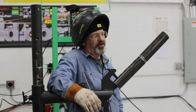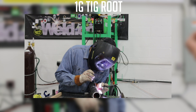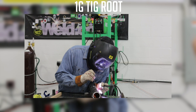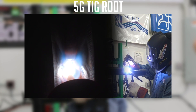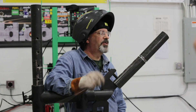We've been doing a series of pipe runs on 2-inch schedule 80. We did a 1G rollout, an exercise where we were doing it in quarters for confidence to get you started on some pipe welding techniques. We're going into the 5G where we demonstrated the uphill weld. We did a 2G horizontal. Today we're doing the 6G.